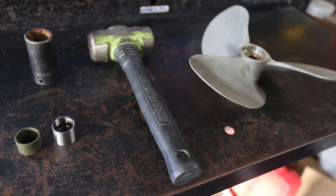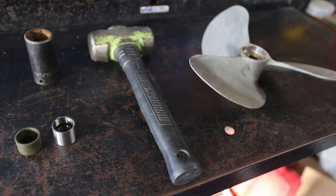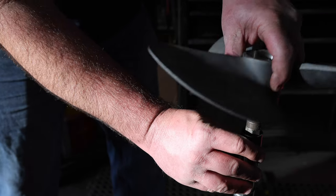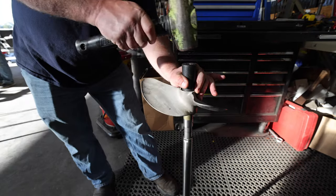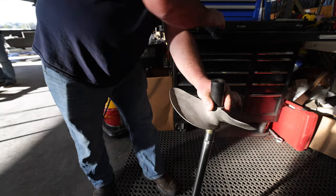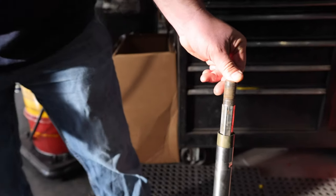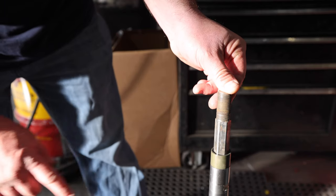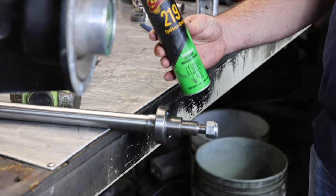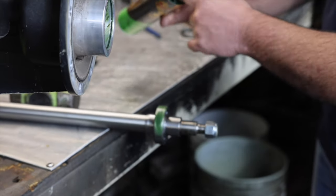Here are the tools you'll need to reinstall the race and sleeve: inch and a sixteenth socket, prop, and a hammer. There are some numbers on the inner side of the race — you want that installed facing away from the propeller. Using the propeller and the inch and a sixteenth socket, put the socket on the inside of the propeller and push them in. Make sure that the race and the sleeve are all the way seated. Flat end to the prop. Now to reinstall the shaft — you can put a little grease on the outside of the bearing and also pack the bearing with a little grease at this time.